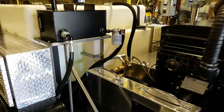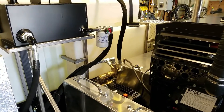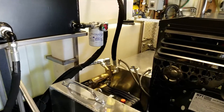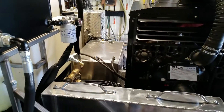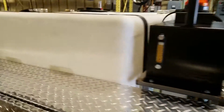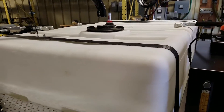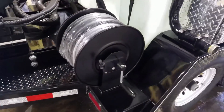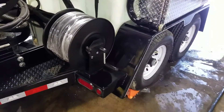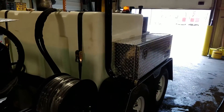We've got a full hydraulic system on this to run the reel. We've also got an 18-gallon antifreeze tank you can see tucked back in there. We've got a 27-gallon fuel tank. And as we go back, your 350-gallon tank that's also got a level indicator over there on the other side. We've got 150 feet of garden hose on a reel that you can use for tank fill and also for wash down after you're done jetting. We've got 2-inch hydrant fill.